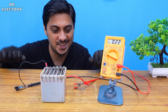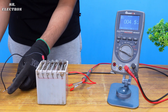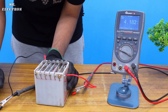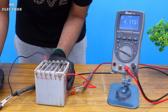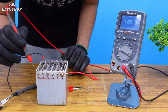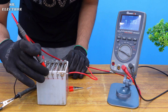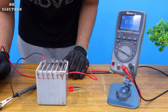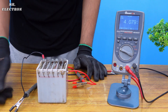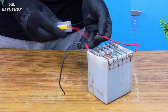Now that the current test is complete, let's quickly move on to the voltage test: positive to positive, negative to negative. The voltage is 4.186 volts. There is something not quite right — I had hoped for more voltage. Let's check cell by cell: I'm getting only 0.7 volts on one cell, 0.3, 2, 0.7. Voltage is less — I think there could be some possible contamination. I only had this much potassium hydroxide, so I'll have to buy more for further tests. But let's try running some actual loads with it and see how it performs.